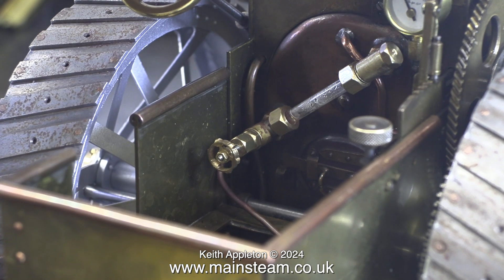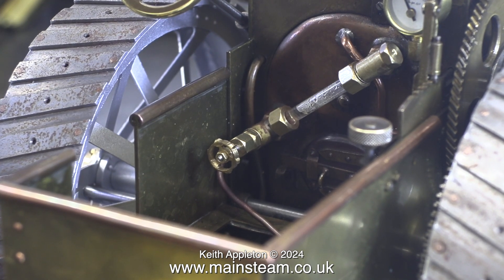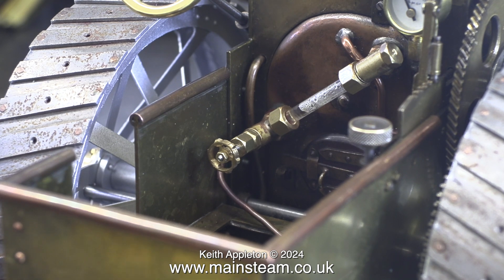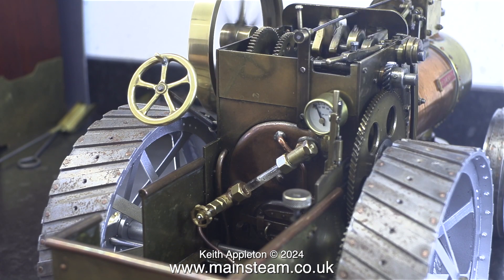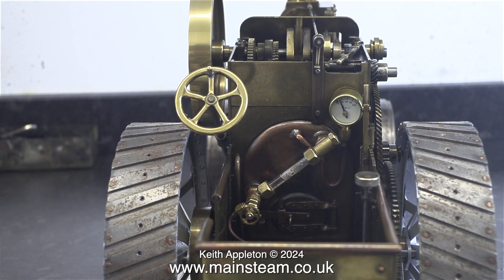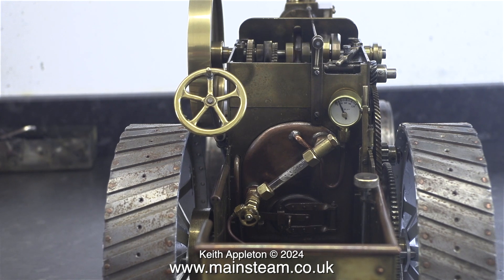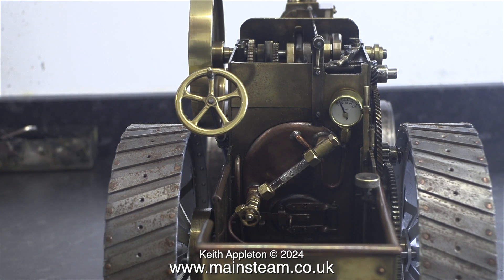The amount of steam produced with this burner was considerably better than when the two burners were just side by side on a metal plate. I need to make sure the boiler doesn't run low — this is a soft-soldered boiler so it certainly would not be a good idea to run the water low. It's safe enough though; it's not coal-fired so if the water did run low I'd just remove the burner. Here I've closed the bypass valve so the water has been pumped into the boiler. If the engine is running too fast the balls in the ball valves bounce about and that's the noise you keep hearing. The water level in the water gauge is rising and the pressure gauge is showing about 15 pounds per square inch. I fitted a pipe from the blow-down valve on the water gauge which empties into the water tank and warms it up, so when I'm pumping water into the boiler there is very little in the way of a pressure drop.